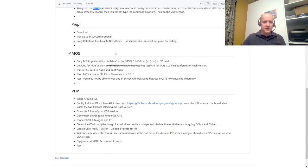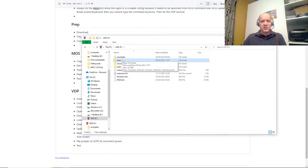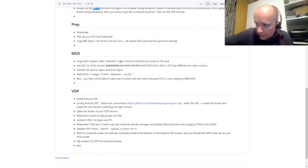Let's get stuck in. Let's start by updating the MOS. I've got my SD card here locally. I've uploaded the latest 1.03 final MOS dot bin file to the root in the MOS subfolder. And I have the flash dot bin utility — that's the updated flashing utility. You put that in the MOS folder so you can call the program 'flash dot bin' as a MOS command, which is necessary because you need to pass arguments. MOS in the root, flash in the MOS folder — that's it. I'll take that and plug it into the device.